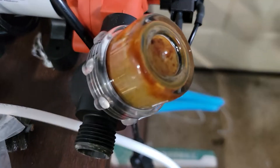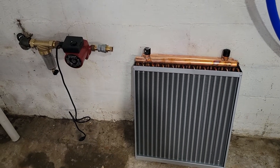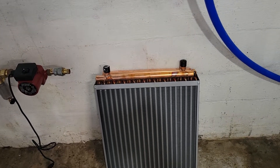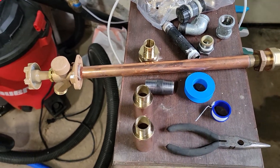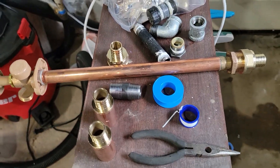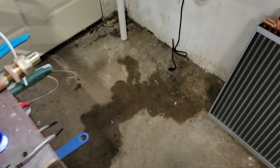As you can see, it gets a little rusty because that was the old filter. I'm going to attempt this, and when it's all together and running I'll let you know how it works. Basically I'm going to dump the water out of the radiator in the other room to this fitting on the outside of the house, which has a check valve so the water can only flow one direction, and then that will go to a hose that I'm just going to dump back into the tile that is the return line into the cistern.